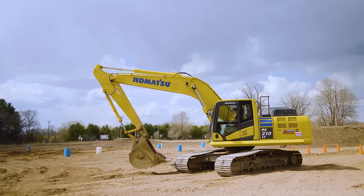The other thing is just knowing your limits on your cylinders and everything like that. They do have hard stops. So if I go all the way on my bucket, it'll stop on its own. Generally, you try and avoid hitting those. I don't like to go all the way to the end of those cylinders with the hydraulics until it just stops on its own. So once you understand the machine better, you'll try and stop before you get to that point.